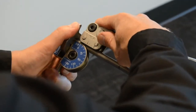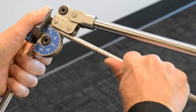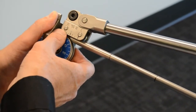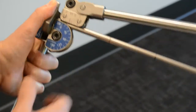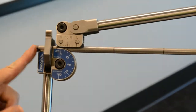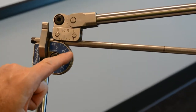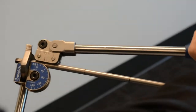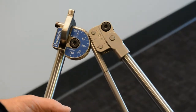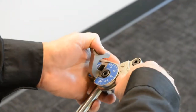So now I line up my zeros, the top and bottom zero. Then I take my mark out to that 45 degree graduation mark, and you can see it's semi-highlighted there. And once again, these go in 15 degree increments, so 15, 30, and 45. So you can see that my mark is on my 45 and my zeros are lined up. My start is down here, and I'm clamped well into the tube bender. Now I'm going to take this zero and match it up with the 45 for my first bend. Allow for spring back and look at it, and I pretty much ended up on my 45. Take it out of the bender,